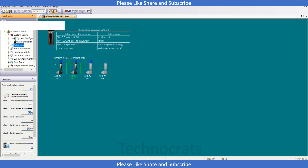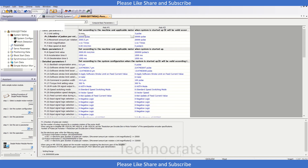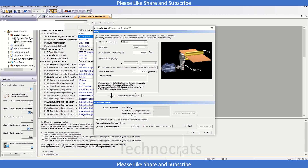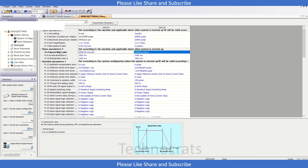Now moving to the parameter section. Here we have to set the unit setting. Let's say it's a roller which is pulling some paper, so the unit is in mm. We need to enter the diameter of the roller — that is DR — here that is 2 mm. And let's say the reduction ratio is 2:1. Click OK and let's compute basic parameter 1 and click OK.